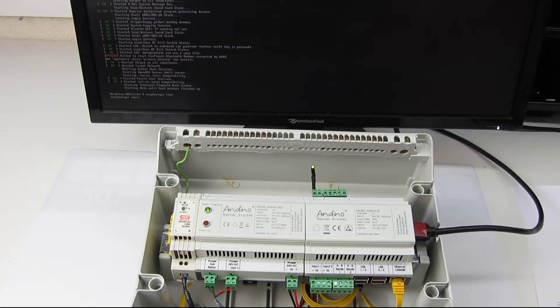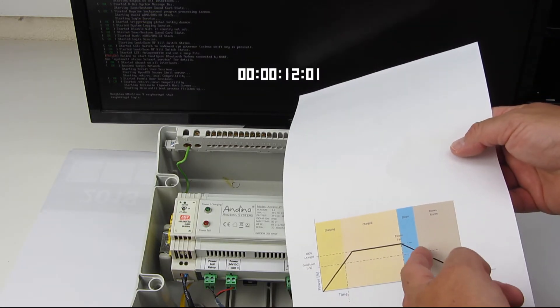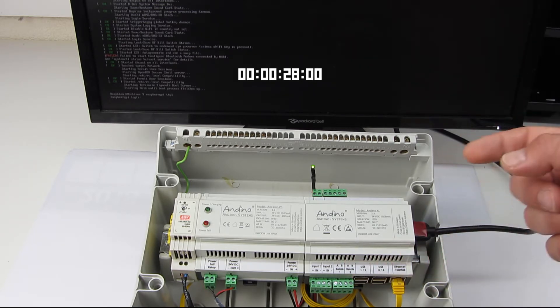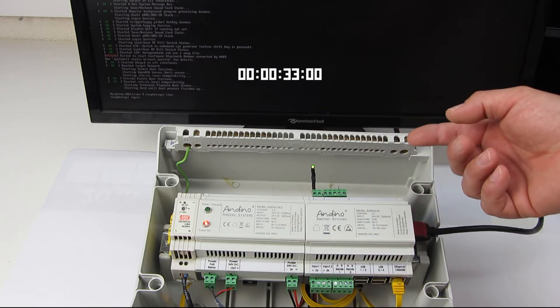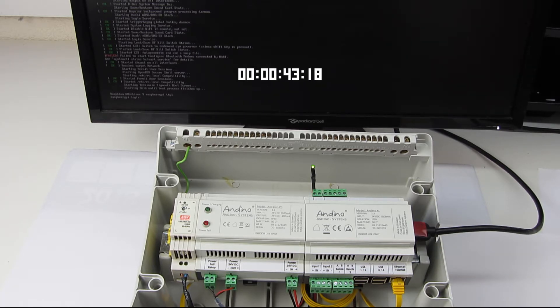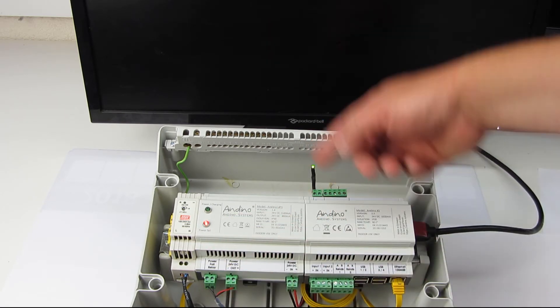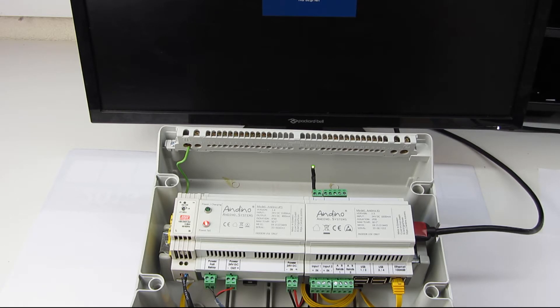I think I can show it. I'll switch off the power. Now we are in power fail mode — in this case we are now in the ramp down phase. It takes some time, I think 30 to 40 seconds. If we go below 80 percent, we can hear a little click. That is the signal on the power fail line. There was a click — that was the power fail relay. We informed the client and the Raspberry Pi shut down. It was a very fast shutdown.